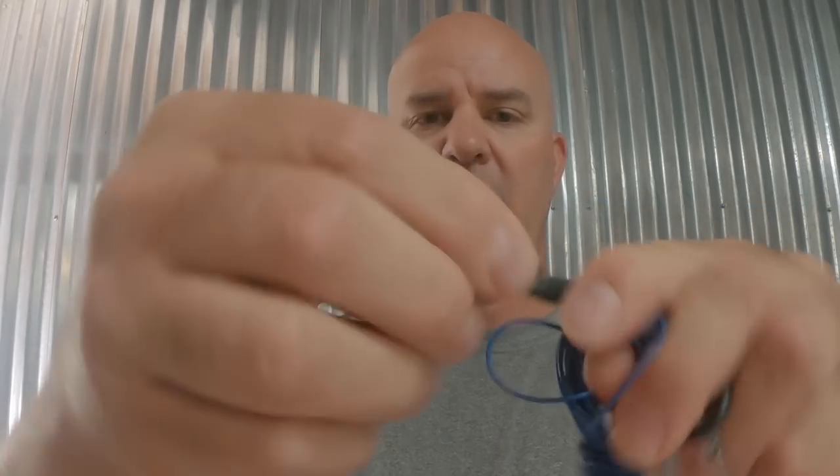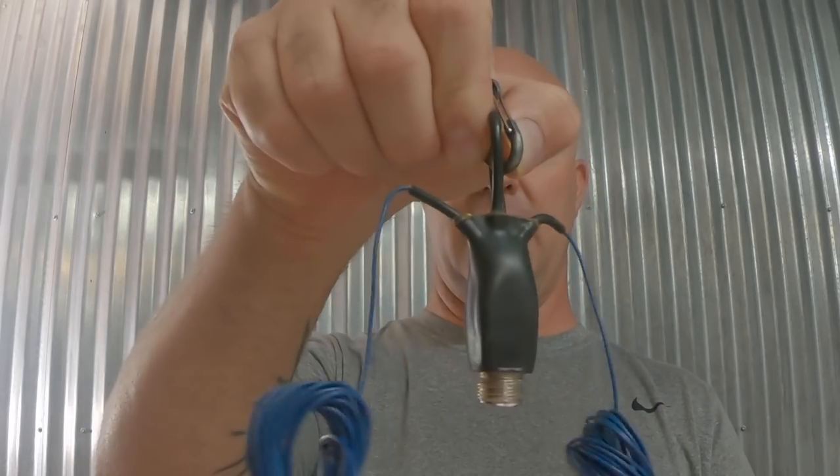This dipole uses thinner wire — probably 26 gauge — compared to my 22-gauge speaker wire. I'm actually trying to find some 26-gauge speaker wire so I can make one with this thin of wire; maybe 24 gauge would work too. I like how the dipole is terminated — it's clean and nice looking, with a loop for connecting the link section and a bullet connector. I had to add a snap link to hang it up.